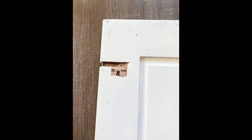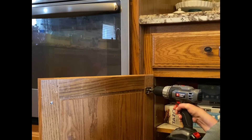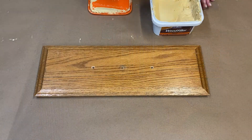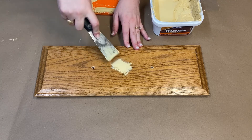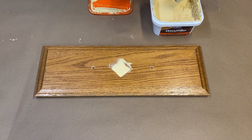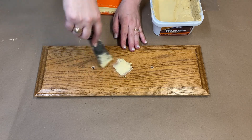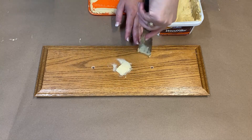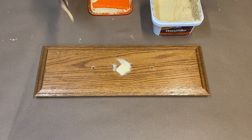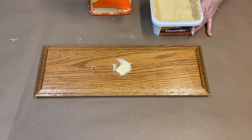Be sure to visit the blog post for my best tip on how to label cabinet doors. Now that you have removed all the drawer fronts and doors from your cabinet bases, you can fill the old holes with wood filler. Apply a liberal amount of wood filler over the old hole with a scraping motion, push the filler in the hole and flatten it. Be sure to leave a thick enough layer so that if it shrinks a little as it dries, it won't leave a divot where the old hole used to be.